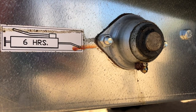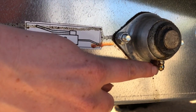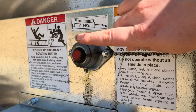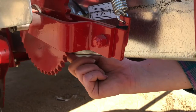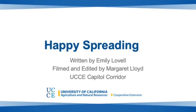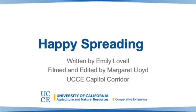The grease bearings and sprockets should be lubricated after every 6 hours of use and just before returning the equipment. There are 6 grease points. Using a multi-purpose grade grease, lubricate the grease fittings until grease begins to seep from the fittings.